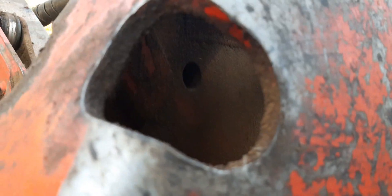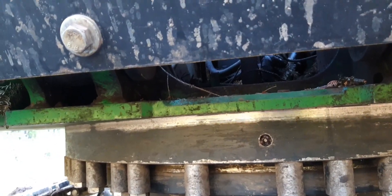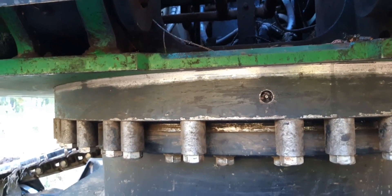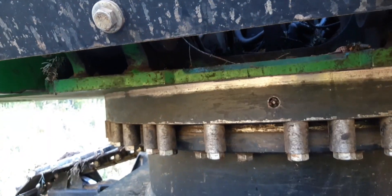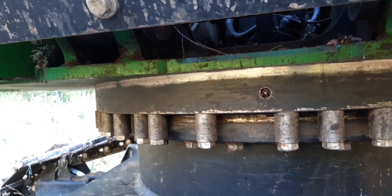Then you go through it — there's another hole right there. Of course you got your rotex bearing there and the bottom of your main boom cylinders. There's also an access plate back up behind the left-hand cylinder that you unbolt, and it greases the rotex gears. This one just does the bearing on the outside, so you've got to actually pull a plate or drill that plate and put a zerk on it to grease the rotex gears.